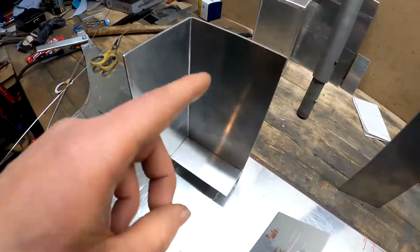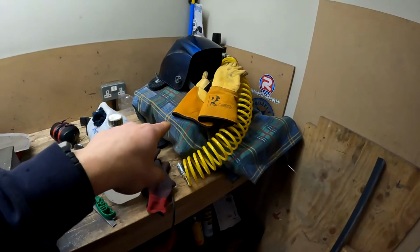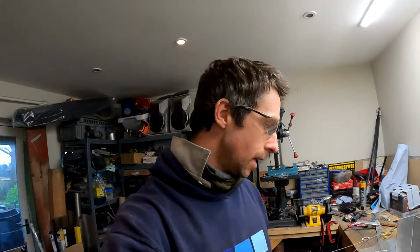So the idea is this should help keep the system de-aerated, which actually, to be honest, is a problem that we've had in the past. Luckily the supercharger's under that fantastic looking sheet, but yeah, that runs at a relatively low temperature, so we shouldn't have any kind of localized boiling, and then we shouldn't end up with an issue with the internal charge coolers breaking down and then leaking coolant into the system.